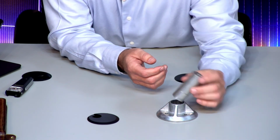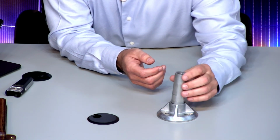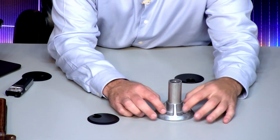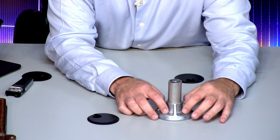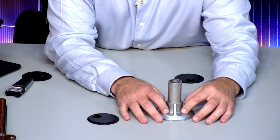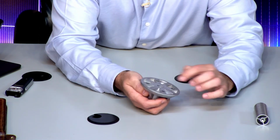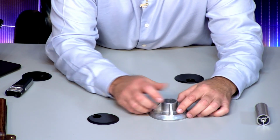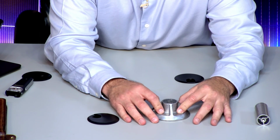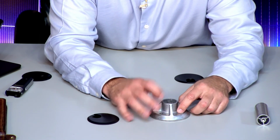So this would fit right in here, and then that bolt that is down here now, I would screw that right in here. This takes the 4 lags like I had a minute ago, those 4-inch lags, or other, depends on the manufacturer, they might have different ones. Before you do that, you put a little sealant around these holes, put it around the outside, set this down, put your 4 lags in it. This is now mounted to the roof securely with that bolt sticking up. Don't forget to put the bolt in the bottom.